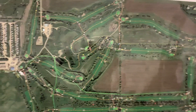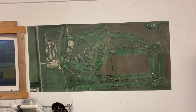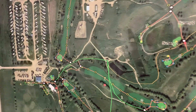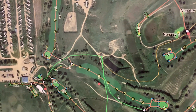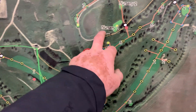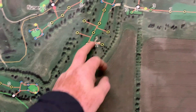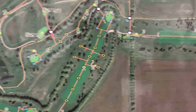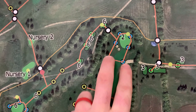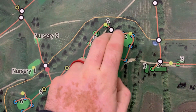Here's the finished map in our pump house. I blew it up to a really decent size so we don't have to ever take it out — I laminated it. Green is main lines, three inch. We have a one and a quarter inch going up past the nurseries, and then in between the holes between heads these are two inches going through here — greens and surrounds. I color-coded blue for tees.